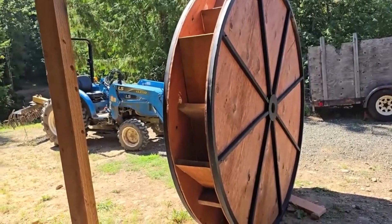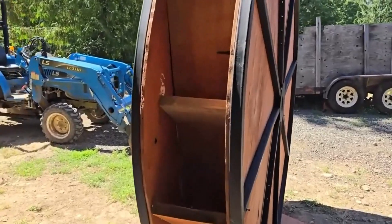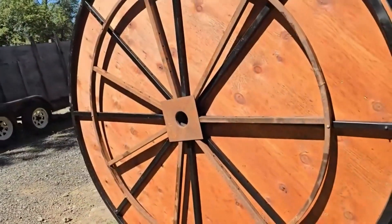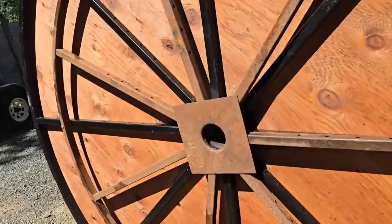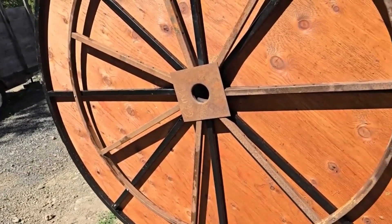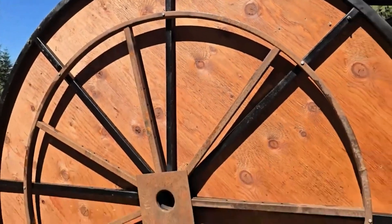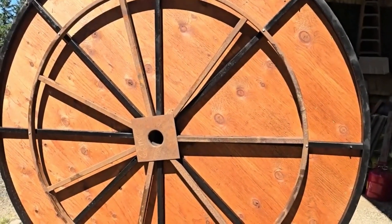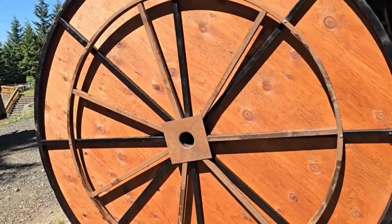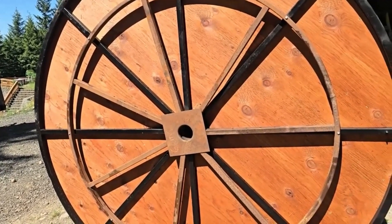The wheel is assembled — seven-and-a-half feet tall. We've got two-by-twelves in the middle and two-by-eights ripped at a 45 for the smaller ones, giving us 16 paddles or buckets. The only thing remaining on assembly is welding the eight-inch metal plate here — I'll drill through it for the spindle, then weld the spindle to that piece of metal. Once that's done I can put the outer plywood on the five-and-a-half-footer, which is what the belt will ride on, and then haul it down to the creek and mount it.